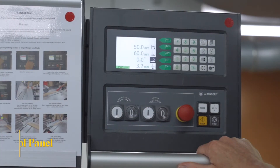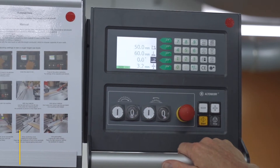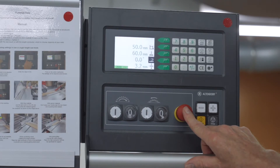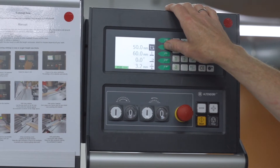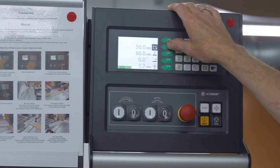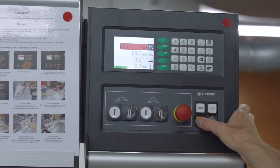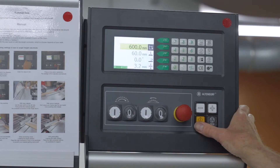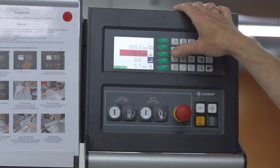You can control the machine with the control panel. The main buttons are on and off. In case of danger you use the emergency button — when you press it the machine will stop immediately. With the green buttons you can adjust the size, for instance the distance between the saw blade and the rip fence. For example, you select the rip fence, press the numbers you want, and then confirm with the start button. The same thing you can also do with the blade height and the blade tilt.